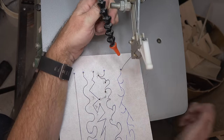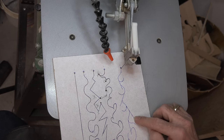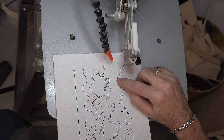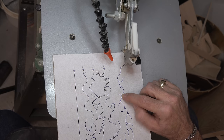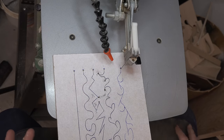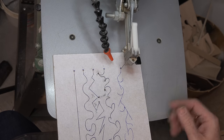The very last one on this particular sheet, number five, is a combination of circles, tight curves, straight lines, and veining lines, and it's not that difficult. You will follow along the line, come around the circle, stop, back your blade up — no need to spin it, just back it up — and then carry on with the cut. Back it up, carry on with the cut, and so on. That method will carry through with some of the projects you're going to encounter in your scrolling career. It's just another practice method to get good at in order to carry those techniques on to your future projects.